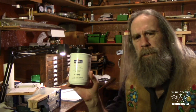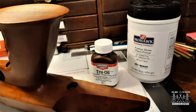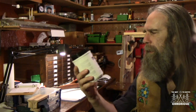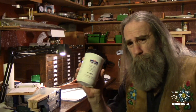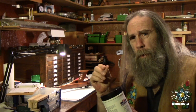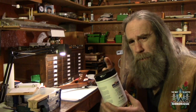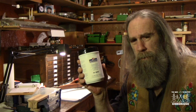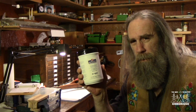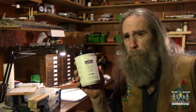It took me about 2 months to get this stuff in. I bought myself some 4F fine grade pumice powder. When I look at the instructions for it, it does appear to be used for this purpose. Like the guys told me, just take a bit of this with some oil and rub it with your finger, not too much, just enough to get that bubbling out, and that could fix that stock up real nicely. So I'm going to give this procedure a try here, and I sure hope it works.